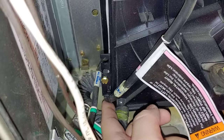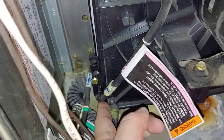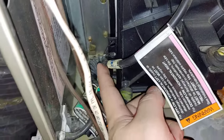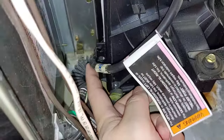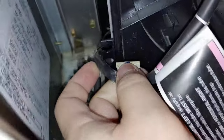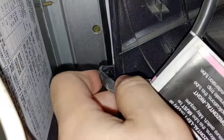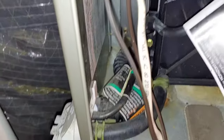Because of the way this was installed 15 years ago, this tube over time got clogged or the inside got a little deteriorated. Someone was lazy or probably had too many beers during the installation. So I basically did this — I said, this is kind of pinched. You got to look for these pressure tubes, see if they're pinched. I went like this, and all of a sudden I felt pressure and the unit turned on. Son of a gun — all these years, that's been the issue. I took the tube, put it right in the little tube holder. That's how it's supposed to be installed. And now it works. It's getting hot.